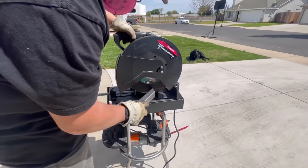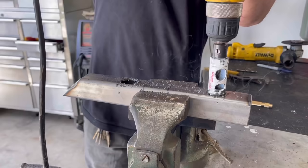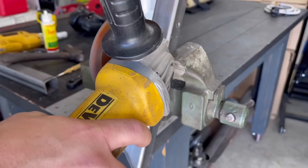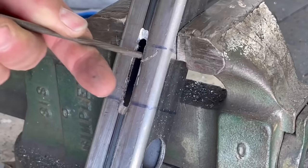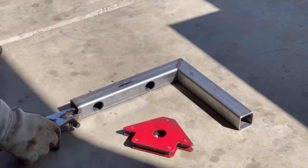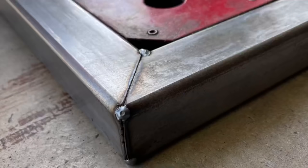The plan is to build a mount using scrap materials — we have to get creative. The inch-and-a-half by inch-and-a-half square tube with 120 wall should be heavy enough. I want to build a mount for an LP propane gas tank: bolt this mount to the trailer and then clamp the tank to it. I also want to make what I call a poor man slot — you drill four holes and use your grinder to cut out the material to make slots, and that's what we'll use to clamp the tank to the mount.